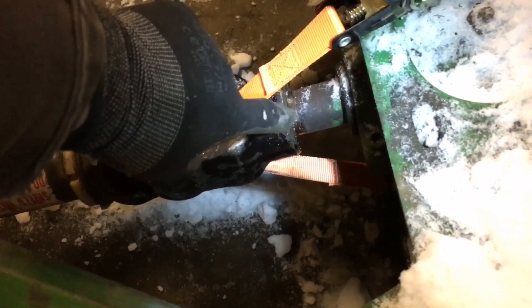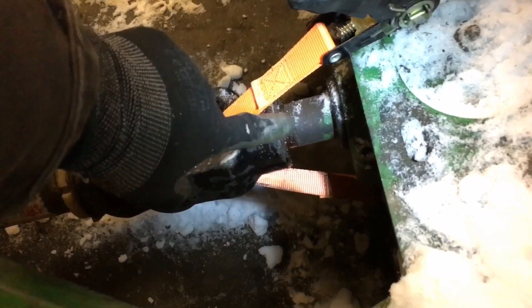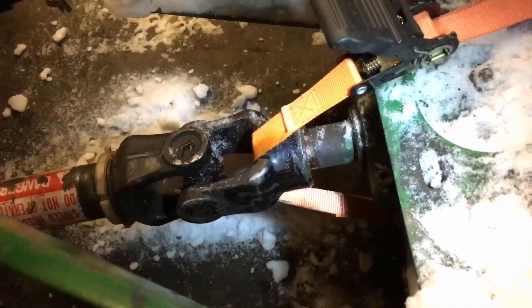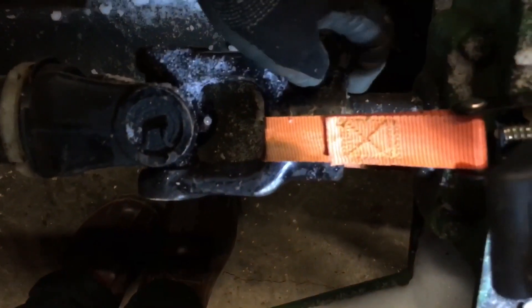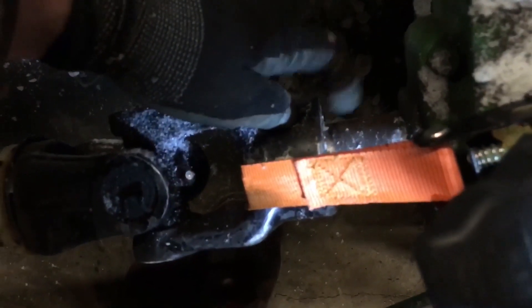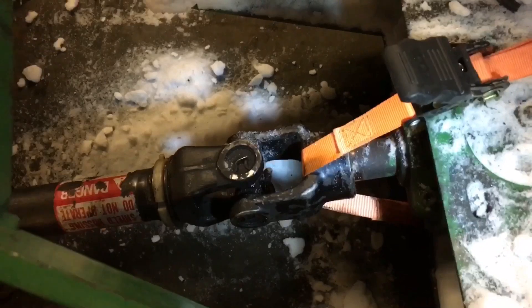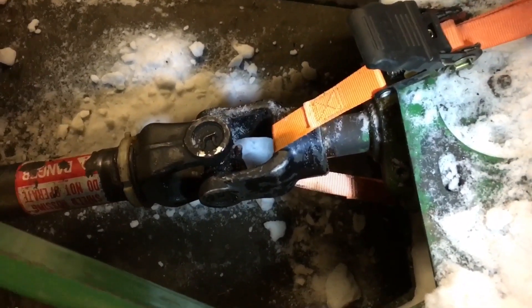You can see the shiny spot on the shaft — that's the distance this yoke still needs to travel onto the shaft. I couldn't get it to go, it was just stuck. There's a key on this side; it's a little dark over here, but the key is almost disappearing into the yoke and it just wasn't going on. I put some lubrication in there and it still wasn't going.